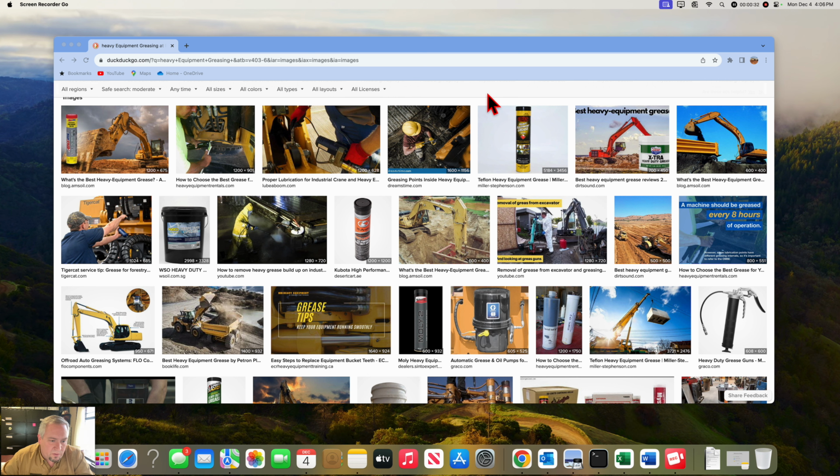We typically use a blue grease from Castrol or red and tacky grease. We don't want to use a moly grease or a lithium grease or anything like that. We want something that's got some durability for what we're doing. There's a Mystic red and tacky, there's a Lucas red and tacky, and there's the Castrol blue stuff that we've been using. That's been a great product as well.